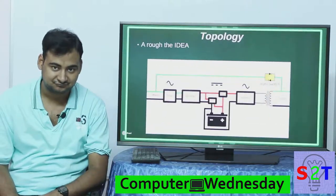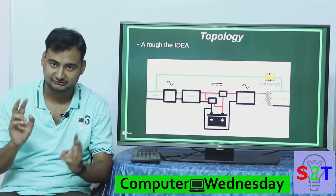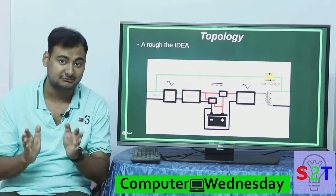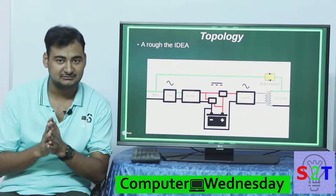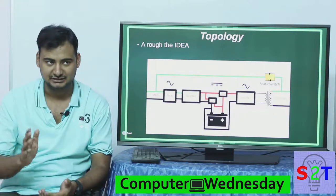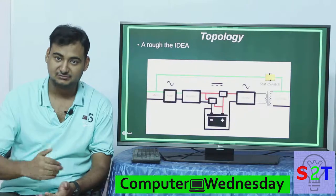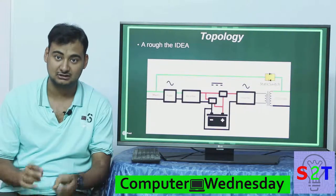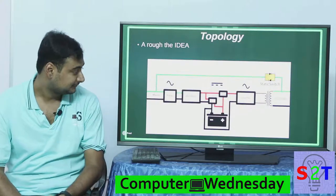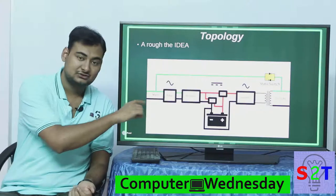This is my rough attempt to explain online UPS. I've seen a lot of diagrams but they kind of neglect or sometimes flat out omit quite important sections. So this is my attempt to explain what is happening and why it's called double conversion UPS. First you get mains power, it comes in and then it goes through a filter.